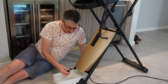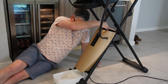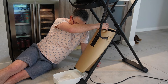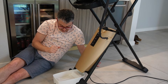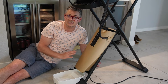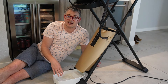It's going to start dumping water out — that's what this nice little bucket's for. I leave it right next to it so I know where it is. Now I can slowly relieve and add some air coming through. As I release this, the water's going to gush out the bottom much faster because you have some airflow. I can see if there's any sediment or anything in there. You want to do this once a month. If it's been a while and you see some sediment, we're going to refill and run it twice.